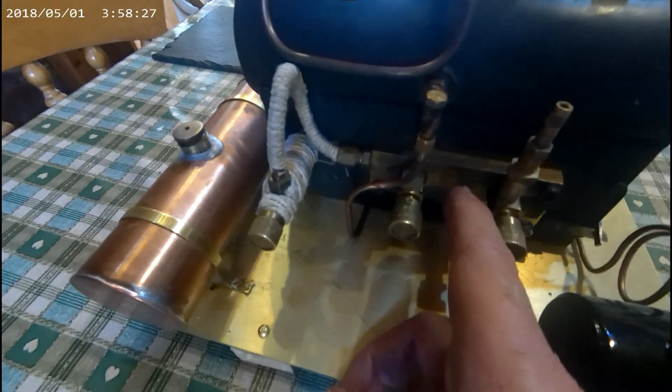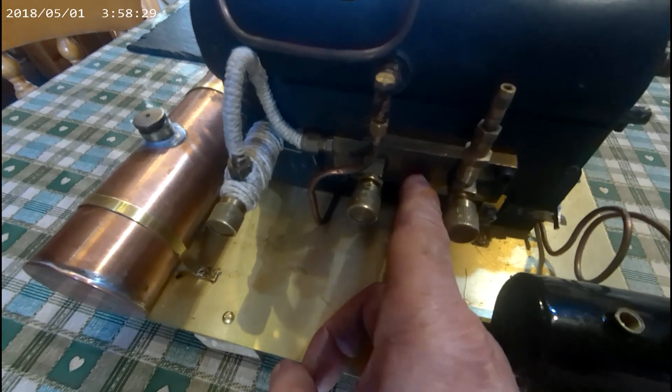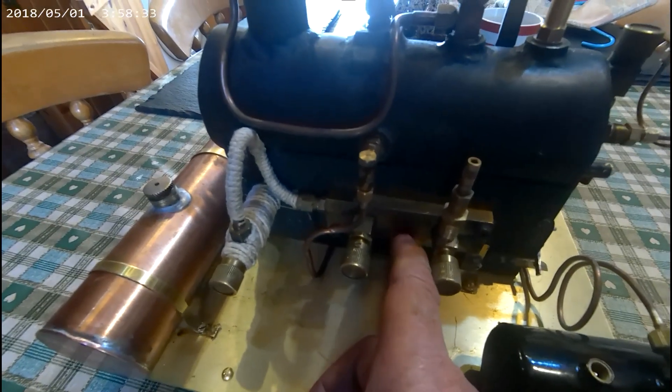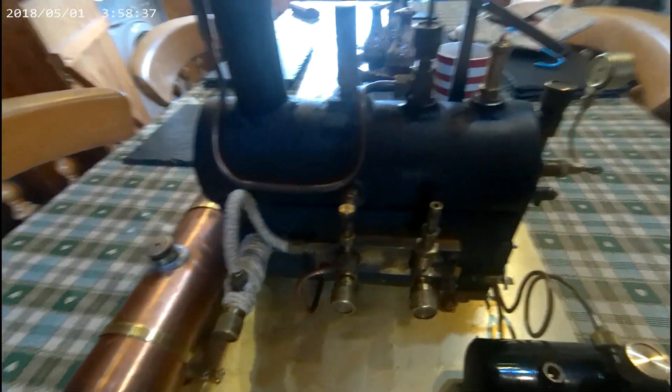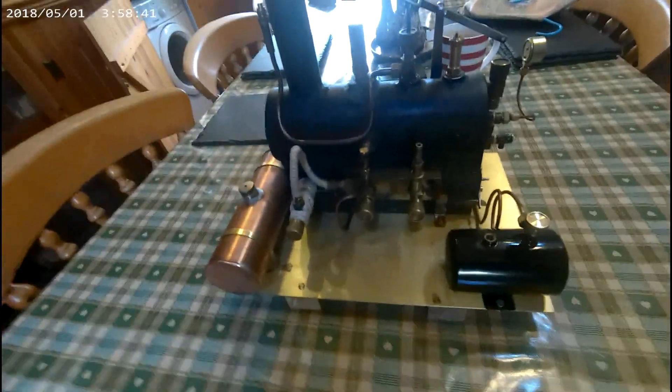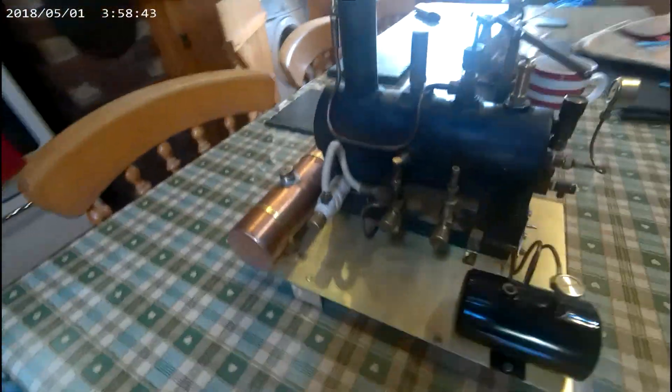I've lagged the end of the superheater dryer here. The next stage will be to drill into the steam manifold and put some sort of drain cock there. So there will be a part two of it steaming — otherwise this video gets a bit long and boring.